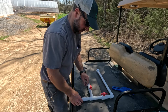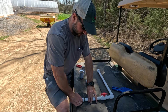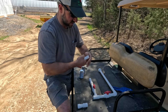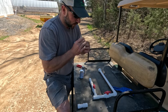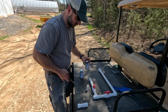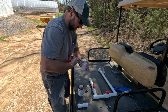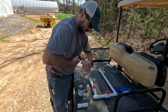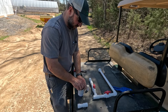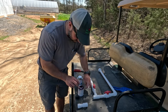Any time I can, I always prefer to glue up PVC on a good flat or semi-flat surface. Sometimes you don't have any other option than to glue it in mid-air. I've found that if you put your glue and your primer lids on with a pair of pliers, they seem to not dry out nearly as fast.